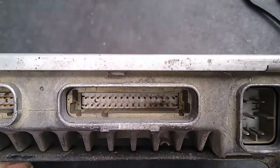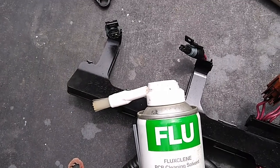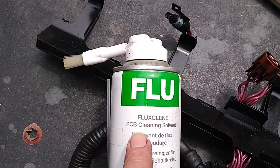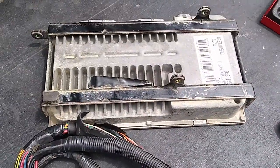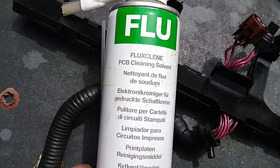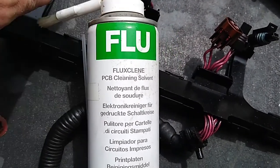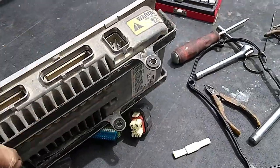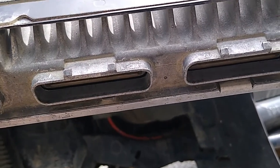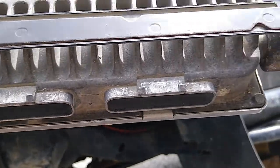A couple of things you can do: clean this out, and I'll show you what you should do to try and clean some of that rubbish out. The best way of cleaning electronic assemblies is using this stuff - Fluxiclean. This is what they call a PCB cleaning solvent. PCB stands for printed circuit board, and that is what is hiding inside your computer. You can get this from JayCar Electronics or Element 14, or any good electronics supply place - probably about $30 a can. What you do is take your computer, turn it upside down, and spray up into the connectors so all the cleaning fluid cleans and then drains out. Then you just let that dry or blow it out with an air gun and you're good as new.